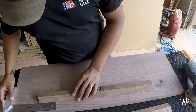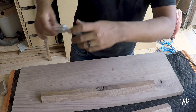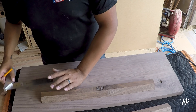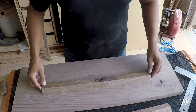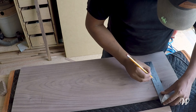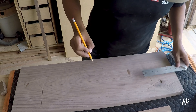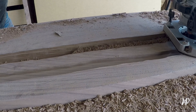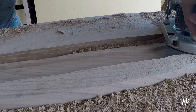But back to the build — before I put anything away, I figured it was time to add some way to mount this to the wall. I went with some French cleats, just using the same walnut I had left over from the board I cut all of this from. I'm just going to mess around with my spacing, see exactly where I want these, and then hog out some wood with the router mostly, then go around and chisel the edges. I hadn't done this too much, and I could have sworn I had a templating bit but I didn't. So I did my best just going back and forth on the router taking out all of this material, then cleaning it up with my chisel — I did a decent enough job, not that you're ever going to see it.